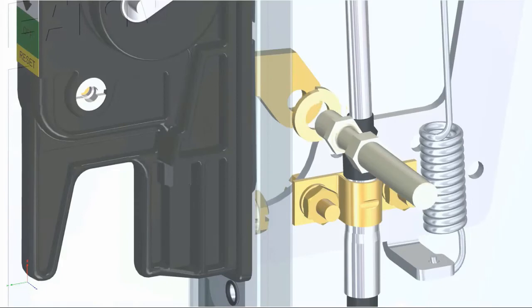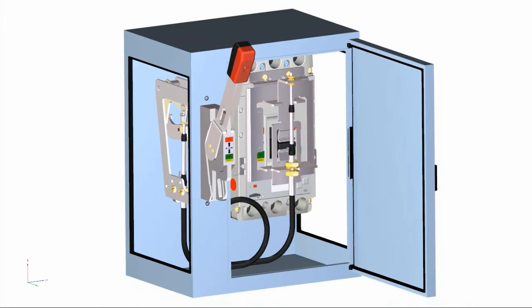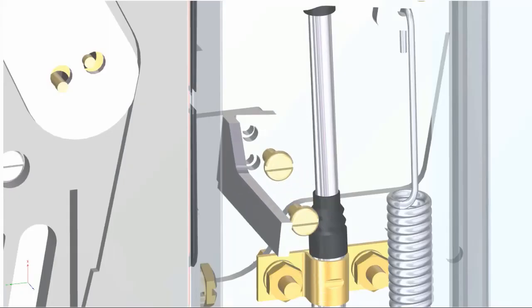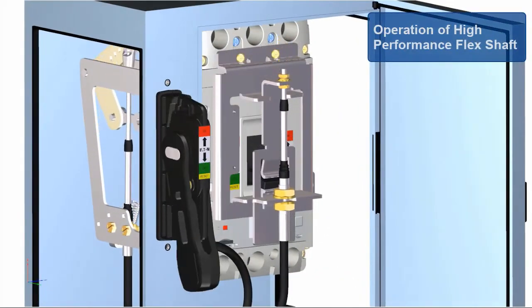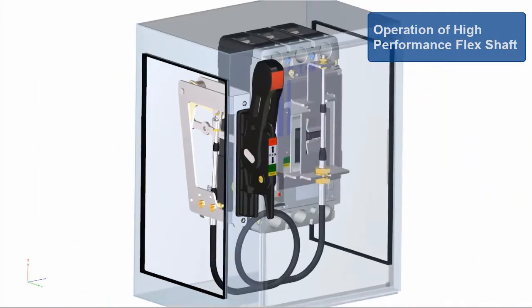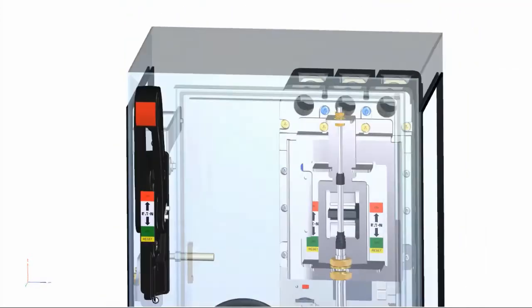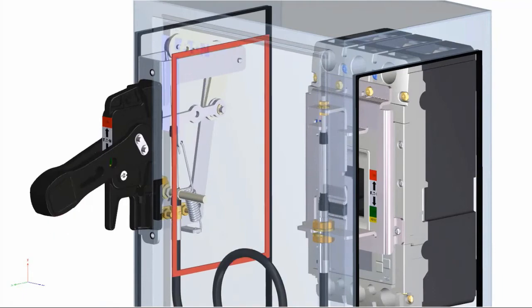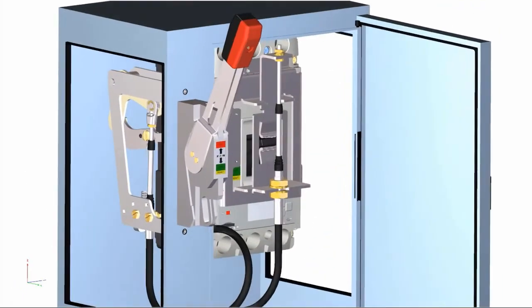Finally, fasten the door interlock pin and lock washer into the handle as shown. For the metal handle assembly, the door interlock tab is installed using the 2 screws provided. To complete the installation, operate the handle mechanism to ensure functionality. The assembly can be operated with either the door closed or by defeating the door interlock lever. Make sure the breaker changes state appropriately as the outer handle changes position.